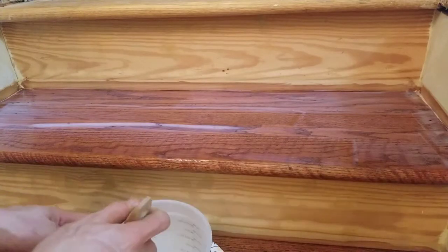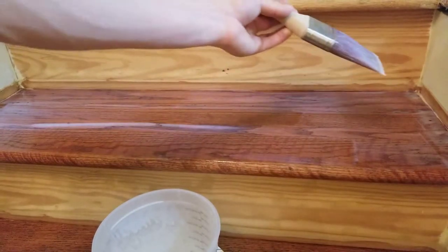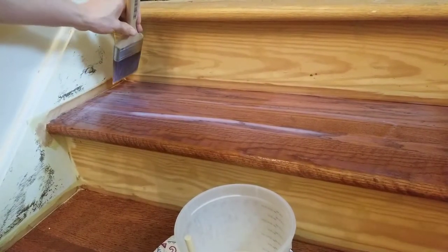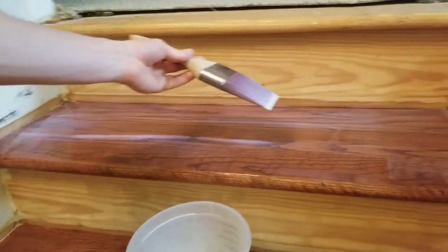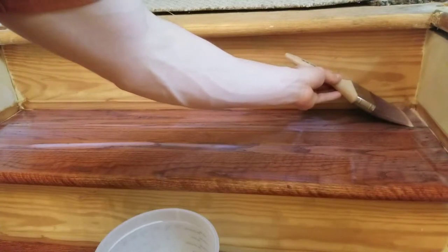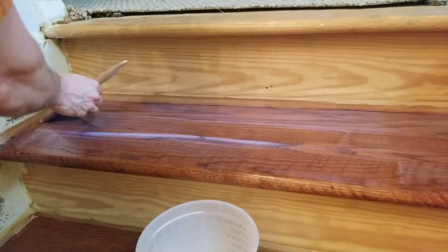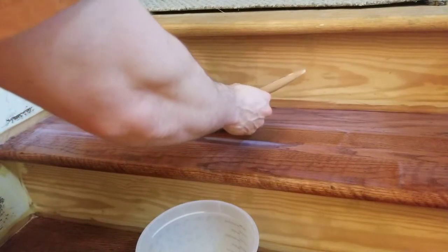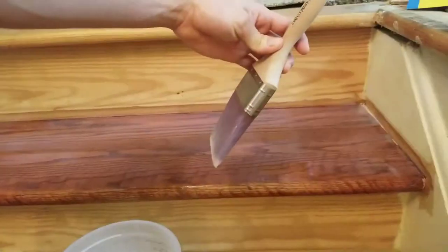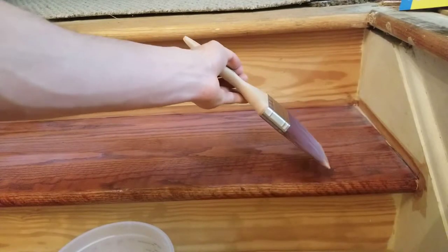Now that I've completely coated the wood, I'm going to get my brush again and bring out any excess finish so it's not carrying any finish at all — just pushing it up against the sides. Now I'm going to start at one end and very lightly move it all the way to the other end. In the corners I'll have to stop and work back to where I ended. This light pass gives a nice even finish, removes any brush strokes, and also helps remove any bubbles. I'm overlapping slightly for full coverage, basically just using the weight of the brush. When I lift off, I lift very gradually so it feathers out on the transition zone.